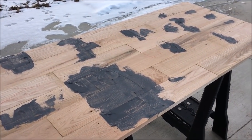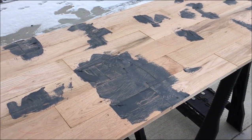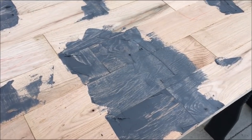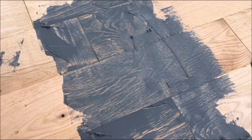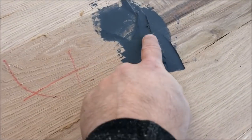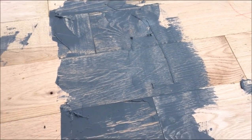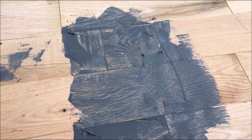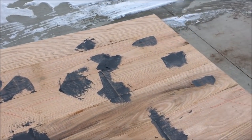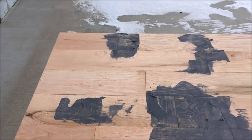It's nothing fancy. The trick to making this stuff look amazing, as opposed to garbage lumber, is to use black putty. It looks awful when you put it on. There were a couple of big knots in this wood — right there and right here. If you put black putty on them and sand it down, it looks like garbage initially until you get it sanded. What it does is it highlights the knot — it'll actually look amazing when done. I'm going to sand it down with the belt sander, then put a quick radius around the edge.